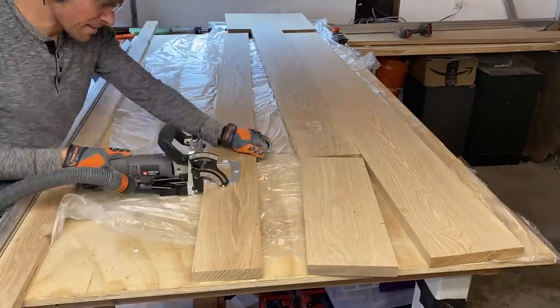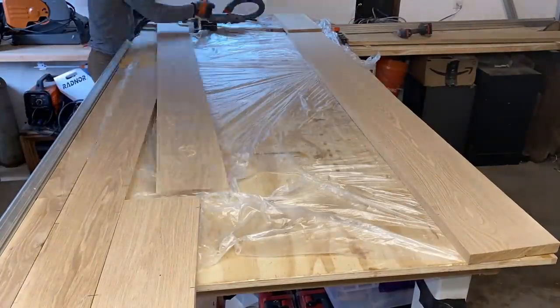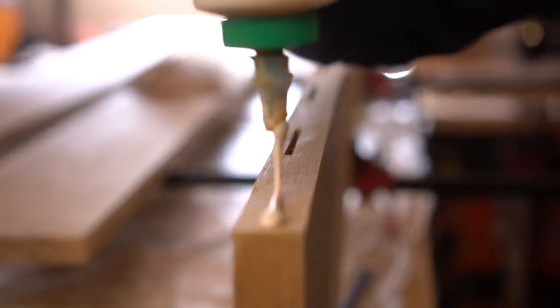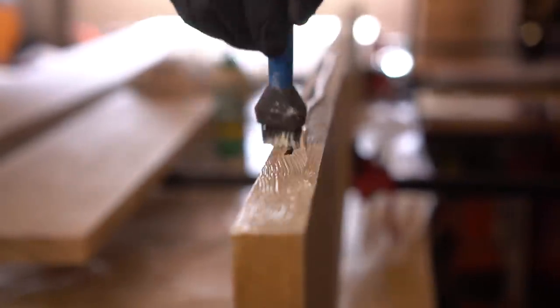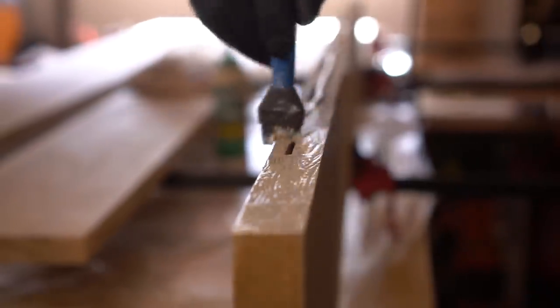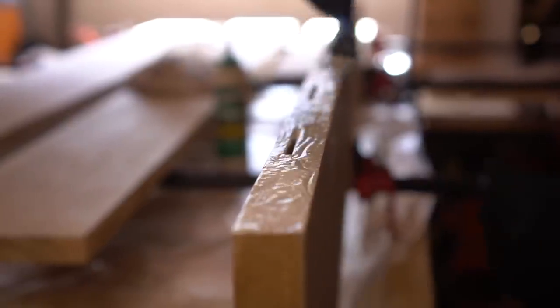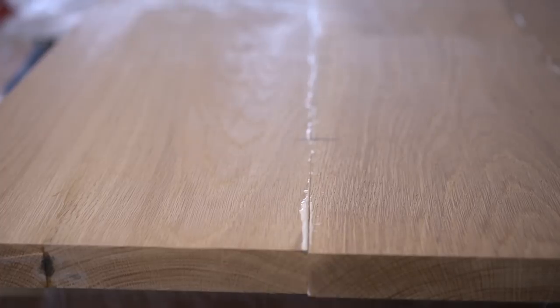All I had to do is mark a line on top of the boards on both sides so I know exactly where to pinpoint my cut. I cut on that center line, then go about gluing up the entire board. I make sure to evenly distribute glue on the entire surface on both sides to guarantee even coverage. That may be overkill, but I want to ensure proper adhesion so these boards will never come apart. After applying glue and inserting the biscuits, I press both boards together — sometimes easy, sometimes needing a little love tap.